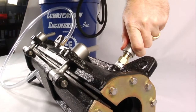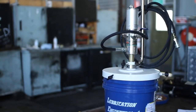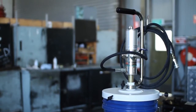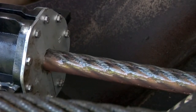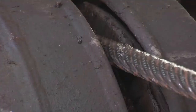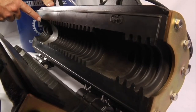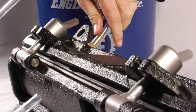Lubricant is applied through the high-pressure coupling into the collar from the grease pump at pressures of up to 5,500 psi and at a rate of 1.5 kilos per minute. With the wire rope travelling through the collar, lubricant is forced into the wire rope core, while also filling valleys and providing a protective coating on the outer wire strands. Lubricant works its way through the seal compartments and exits through the clear lubricant drain hose, where it can be collected for disposal or potential reuse.